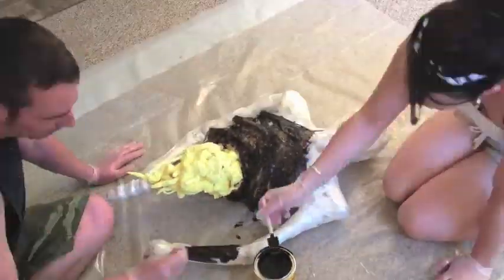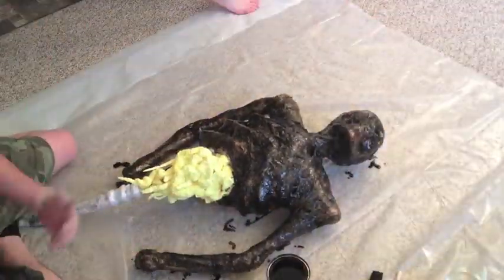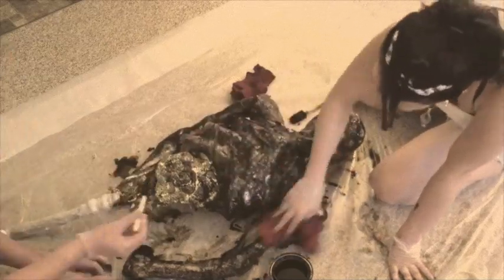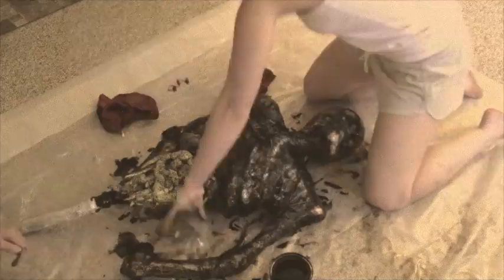Now we're going to start staining. Go ahead and put stain all over the entire front — if you've ever stained wood, it's the same way. When you're done, make sure you wipe it all off. Flip it around and do the same thing on the back. We found out it's okay to go ahead and put stain on the guts and then wipe that off too. Because the stain is so thin, it gets down into all those little cracks and it really helps out the detail later.